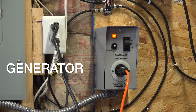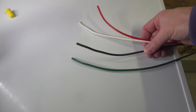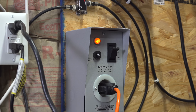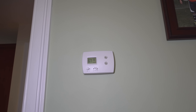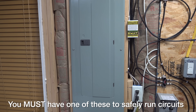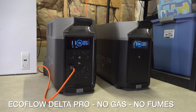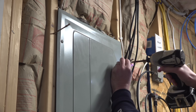In today's video, I'm going to show you how to install a generator transfer switch yourself. This model is the easiest one to install — it uses just four wires. You need one of these switches if you want to power a hard-wired circuit in your house. For most people, that circuit is going to be their heating system. These are kind of universal; they work with gasoline-type generators or a battery power station, even big ones like the EcoFlow Delta Pro. This is exactly what my friend bought — he wants to tie it in to run his heat anytime he loses power.